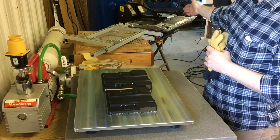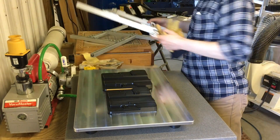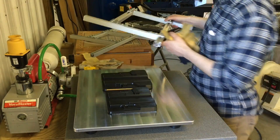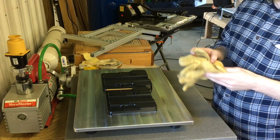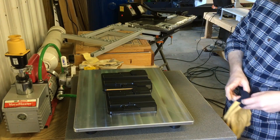The plastic is heating up in the heat press right now. I have already adjusted the frame size to fit around the molds, so as soon as the plastic is hot enough we're going to pull it out, drop it on the molds, drop the frame on, and then start cooling the plastic.